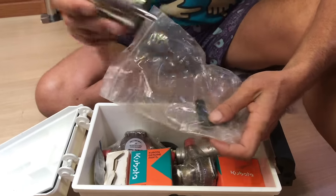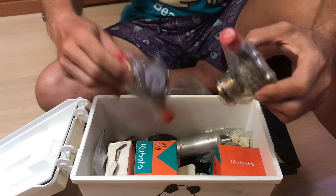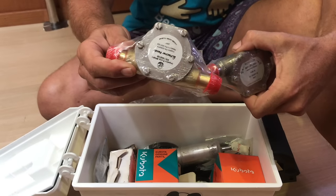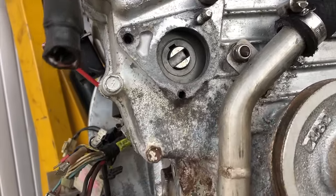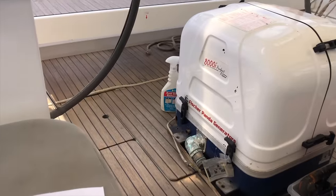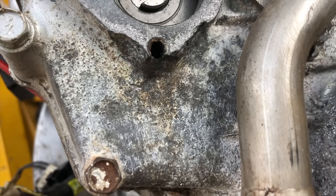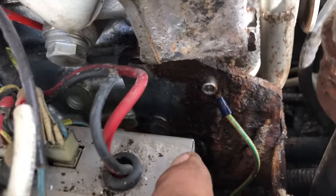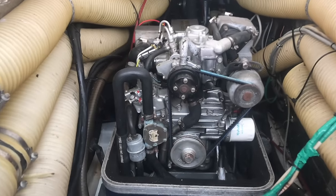If I could find a way to have this throttle servo exclusively handling the needed RPM, this generator would probably be a good generator — at least if all the other hardware components are replaced with better quality products. Talking about quality, another source of serious problems and high running costs is this water pump. Not only does it eat impellers like candy, it also has serious issues starting to leak after not that many hours. Living inside this cocoon surrounded by sound insulation acting as a sponge, keeping salt humidity at an absolute max, the result is corrosion and rust faster than you can spell Panda. I highly recommend ditching this capsule, making a better environment and better airflow for this machine.